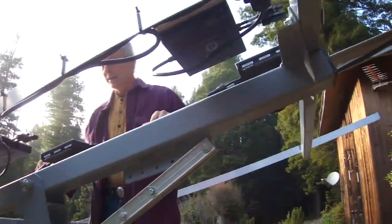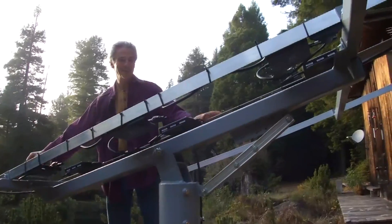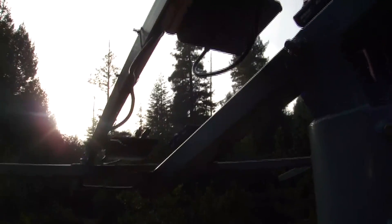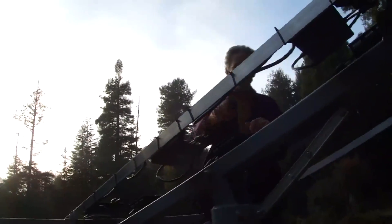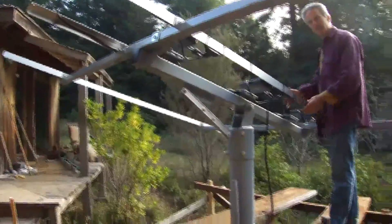When I was laying these out I had to drill holes and these L-shaped aluminum brackets hold the solar array. I started the wiring here so that the cord will hopefully reach down into the box where I connect to my wires that go to the main panel. There are six micro-inverters; I had to start here and work around — you have to figure out your layout ahead of time or you can get fouled up. It forms a loop and ends here. The wiring links one inverter to the next — they provide all the connectors but you have to figure it out. This is a landscape orientation — you can get vertical or landscape profile, and with landscape you get more wire between panels.